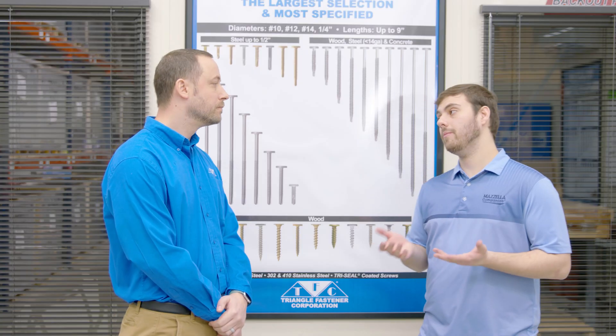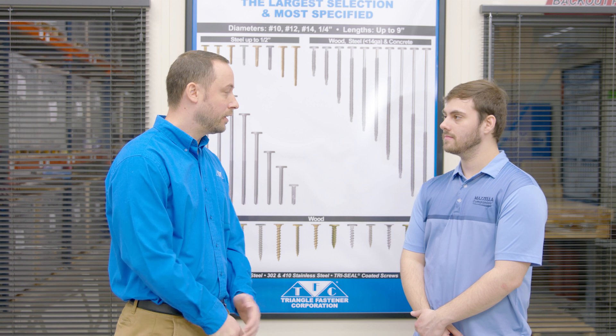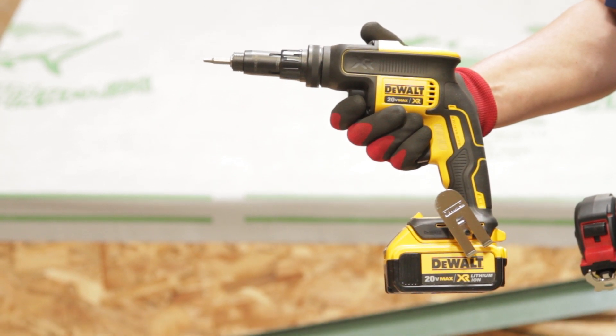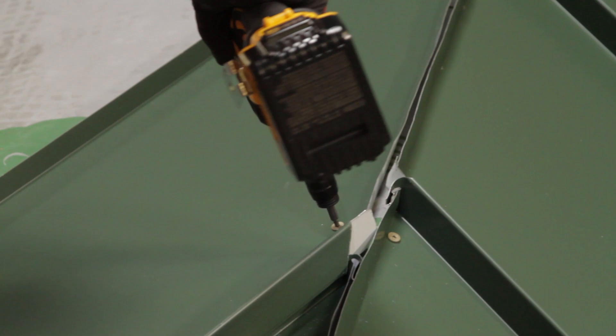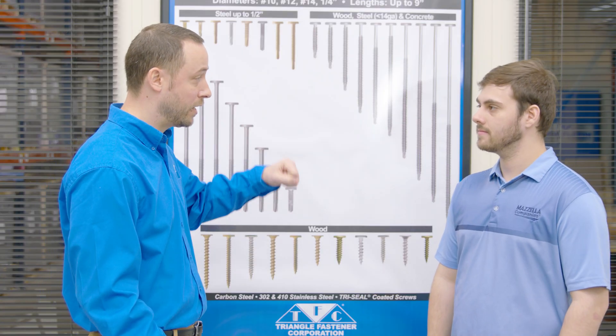What tools and RPM speeds would you recommend? Most everybody likes to use impacts — they're easy and cheap, and they run at a similar RPM to what we recommend. But we don't recommend them because of the strength and torque. What we do recommend is a tool that has an adjustable clutch on it, so depending on what substrate you are going into, you're always getting the correct seating of the fastener. An impact is essentially like putting a wrench on a bolt and hitting it with a hammer — it only takes about 70 pounds of pressure to break a fastener.